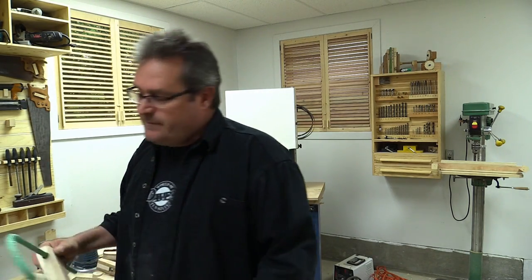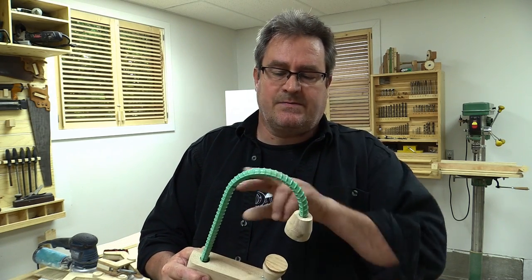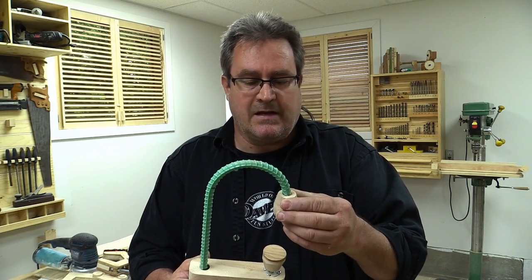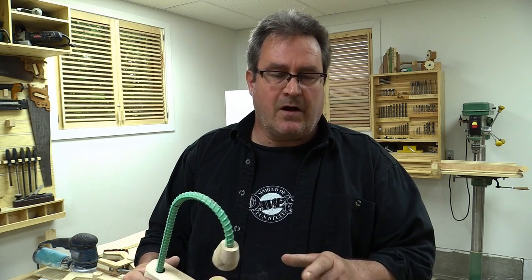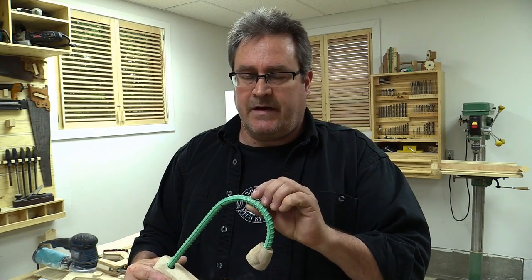And in general terms, you don't have to heat rebar before bending it, especially in this kind of a curve right here. It can easily be bent into that shape. It's done every day out on construction sites. They bend rebar without heating it, and it really doesn't have that much of an effect on the strength of it.